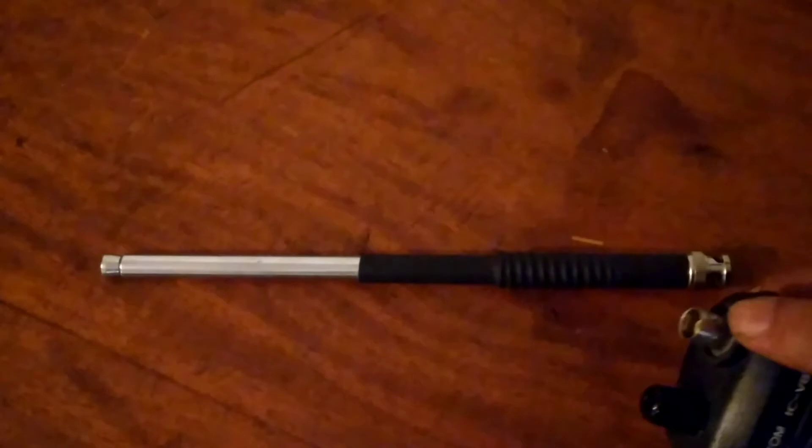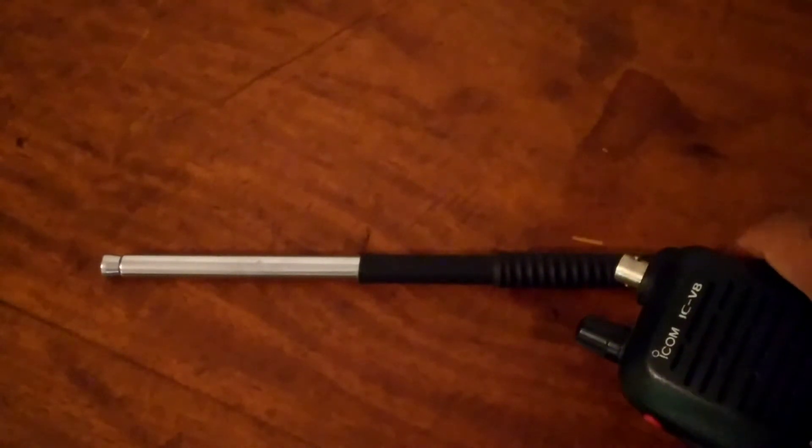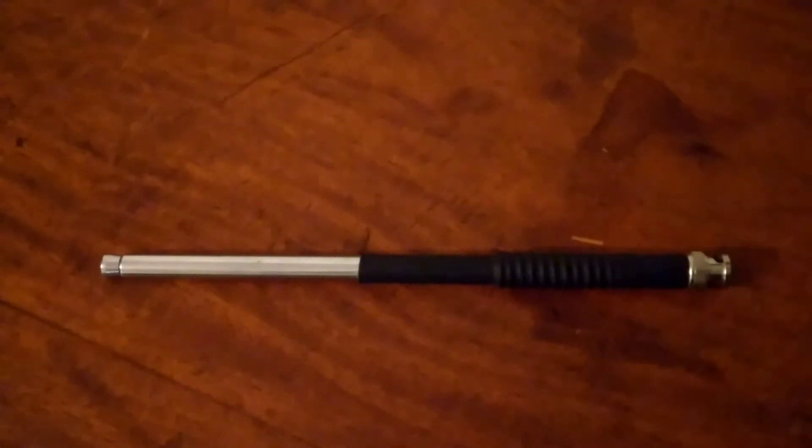But keep in mind, this is a very tall antenna. I know 2-3 people who, when using telescopic antennas, had some issues with the mounting and antenna connection area. So when you are using it, always keep it vertical. Don't bend it — otherwise you can damage the radio.